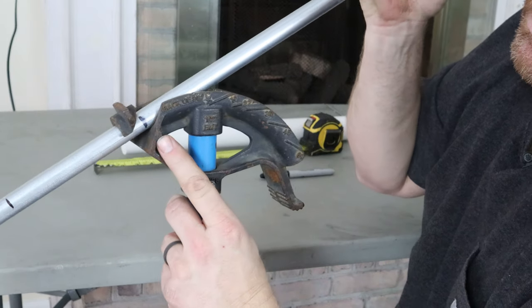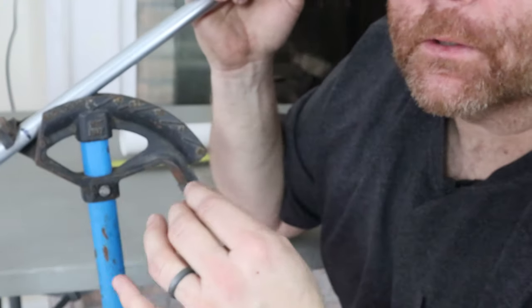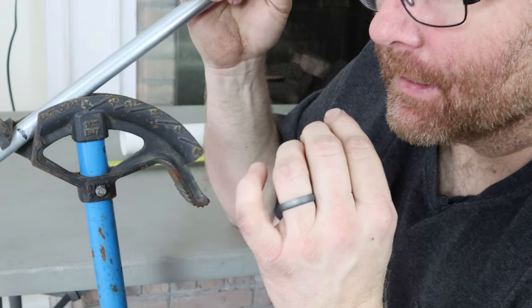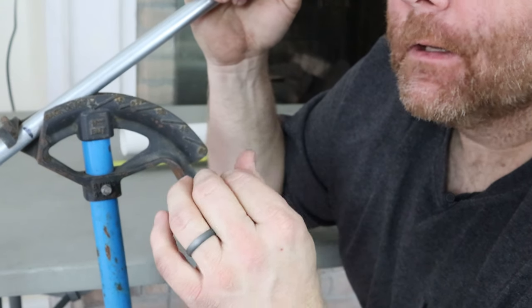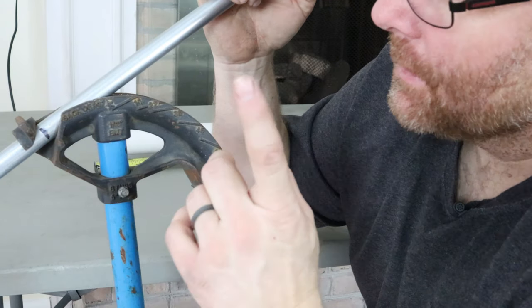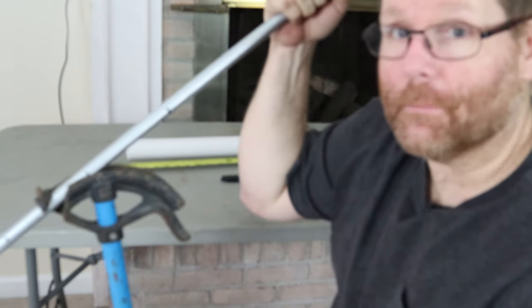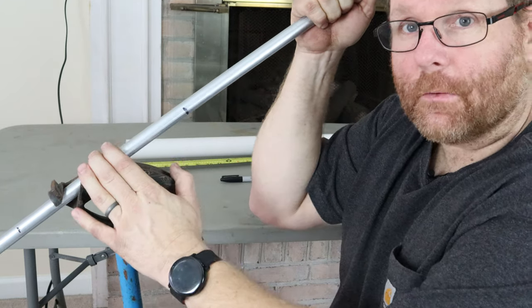After you pull to 45 degrees, both sides of the pipe are bowed down. You'll then slide the pipe to the arrow and bend it to 22 and a half degrees — I just go to 22. I've only done a three-point saddle perfectly on the first try a few times in my whole career. This takes time. I would rather take an extra five minutes to get it right than have a big dog leg in it.